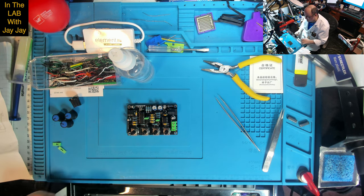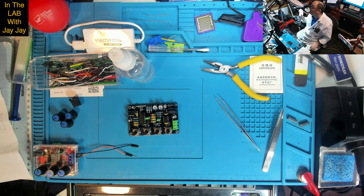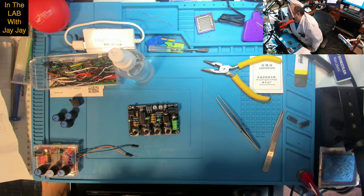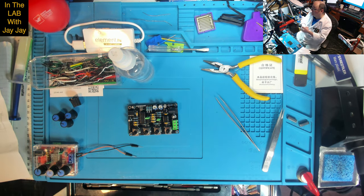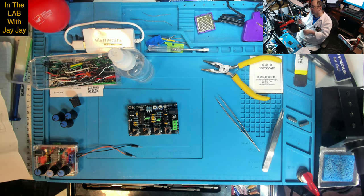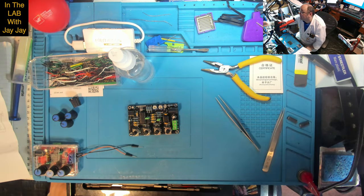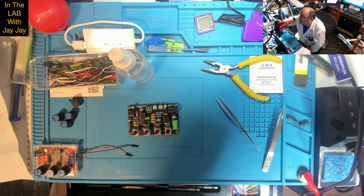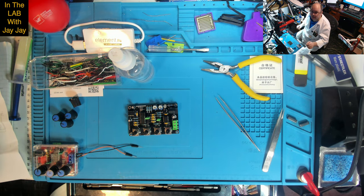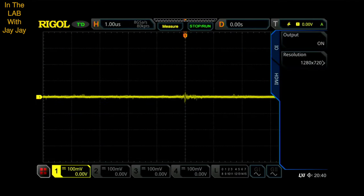Now, we're going to want to stick him straight into an oscilloscope. So let's get a BNC cable with probes on the end of it. That's what this is. So we put him in on channel one. Now I'm going to have to configure this guy so that you can see it. So that's utility, IO, HDMI, on. And then we should be able to show you that if I just hit that there. All right.